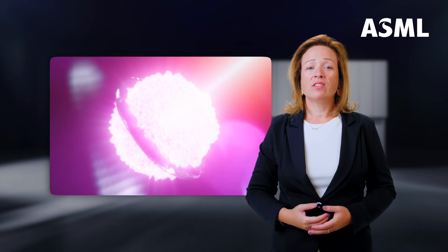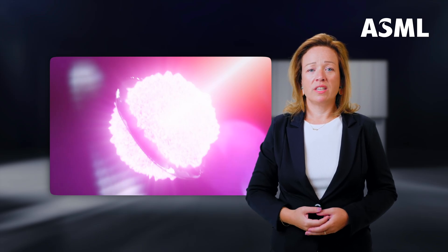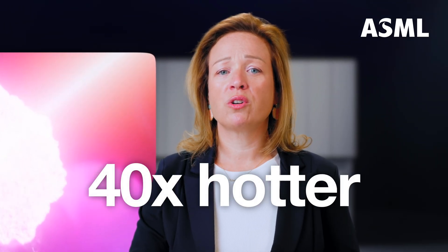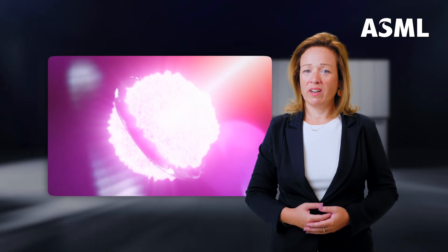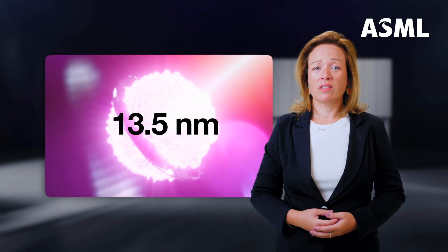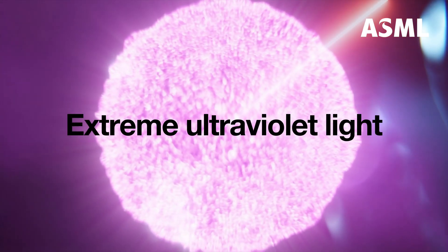Next up, it's fireworks. We fire a high intensity pulse at the pancake, instantly vaporizing the tin and turning it into a plasma that is 40 times hotter than the surface of the sun. The plasma emits a wide range of wavelengths, but with a clear peak at 13.5 nanometers, which is the kind of light that we're looking for — extreme ultraviolet light, nearly X-ray.